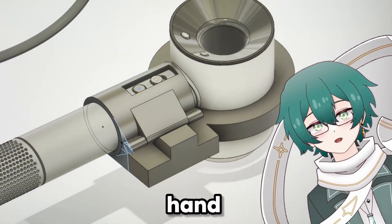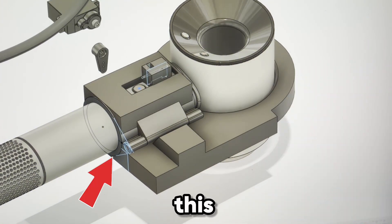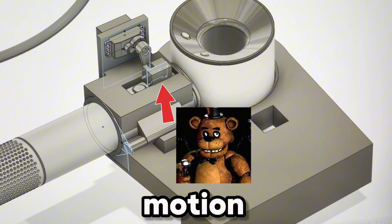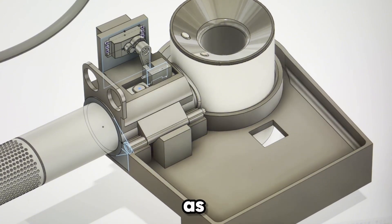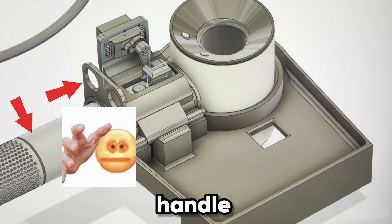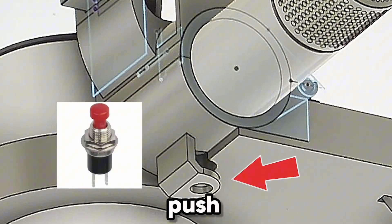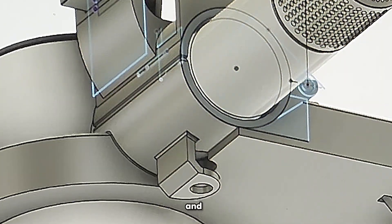I cut up version 1 of the hand dryer converter. The idea is simple — the hairdryer sits in the cradle while this clamp thingy clamps down on top. A servo moves the hairdryer switch on or off via a slider whenever the motion detector detects movement. If I want to grab the hairdryer and use it as a normal hairdryer, there's an ultrasonic sensor that detects my hand on the handle and instantly opens up. I'm using a geared motor and some bevel gears to automate the clamp. There's a little push button that confirms if the hairdryer is in the cradle or not.